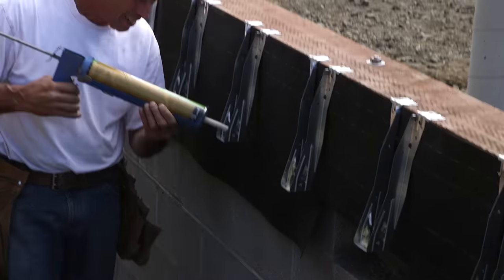The second reason is that I want to transfer the load-bearing capacity from that pony wall down below up to the floor diaphragm, the decking. One required way to make that happen is to put blocks in at the bearing point below to transfer that strength up to the floor diaphragm.